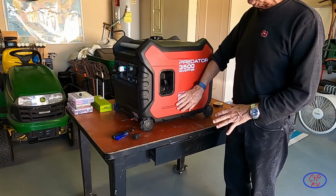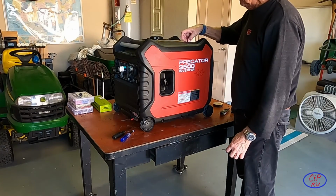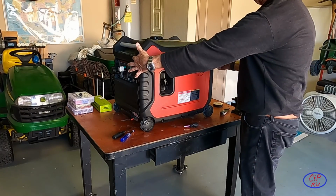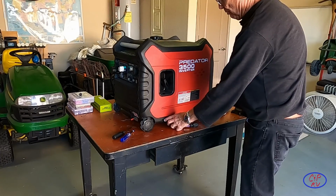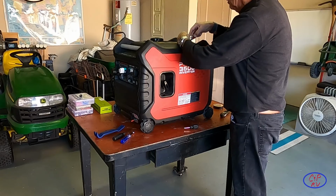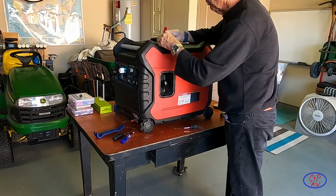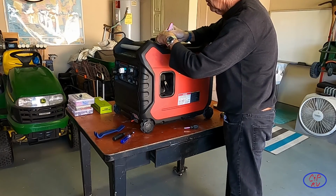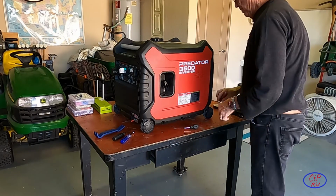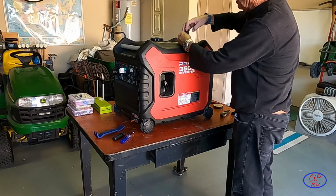First step is to take this side of the cover off. Pretty straightforward. You've got to get two little rubber plugs out right here. We've got screws on this end and this end. There are 3 screws across here. Let's get after it now. I'm going to use my pocket knife to gently pry these pieces out of the top here. 2 rubber plugs. And we're going to set our parts over there. And we'll just start taking the screws out.